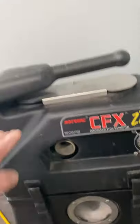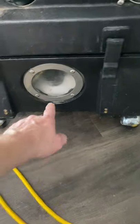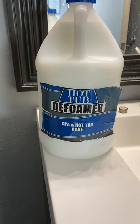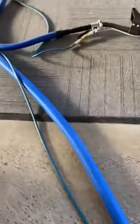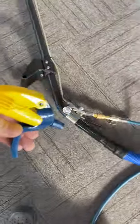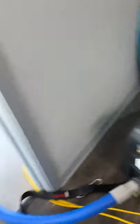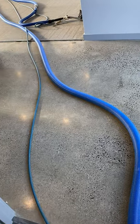One of the weaknesses of this machine — as you can see, it's small, only about 27–28 inches high — is foam. You can see the foam in there. What I do is keep a container of hot tub defoamer in a squirt bottle, and when I start cleaning I take the end of the hose off and put a few squirts right into that nozzle. That'll last me a whole job usually. If I'm dealing with an extreme amount of foam, I might put a few squirts in per room, but it's a very negligible expense.